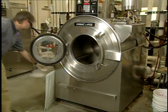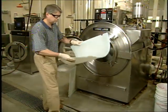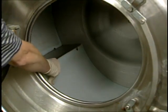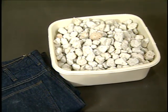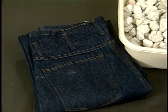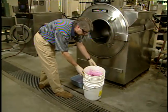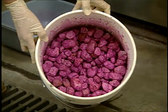To prepare the garment machine for acid washing, it must first be drained so that no water is left in the drum. Then the drum holes are covered with a plastic liner, which keeps the potassium permanganate-soaked stones from falling through. Typically, pumice stones are used, weighed at a ratio of 2 to 1 to dry garment weight. The stones are soaked for 2 hours in enough potassium permanganate solution to just cover the top of the stones. The concentration of the solution can be altered depending on how much discharge is desired.